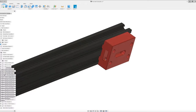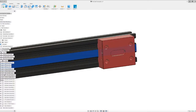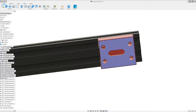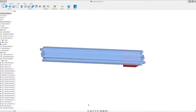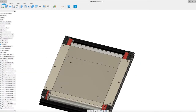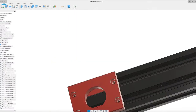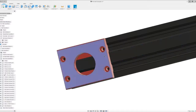Over time, we will see. You may want to drill a hole right here and put a stop in this frame — it could be a pin, it could be a bolt; it wouldn't even have to be threaded. You could just stick something in there so that when you tension on this end, if it slides because the tension is so strong, it butts up against a bolt or screw sitting in there. You could do the same thing on the idler side — it would have to be equally strong — and put something around this area to hold the printed piece in place in addition to the four screws and nuts.